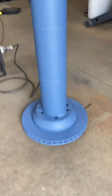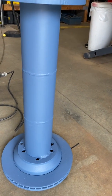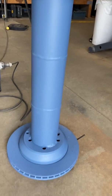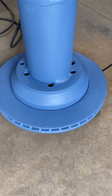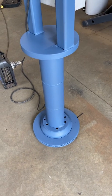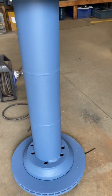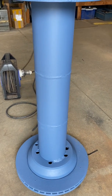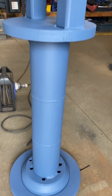What I did is I made a disc and I've had three tubes welded in. Because that's cast iron, I had to preheat it so that the cast iron wouldn't crack when I was welding it. And then all those pieces are just sections I had kicking around, so that's why it wasn't one length — it was three lengths that I had welded together.